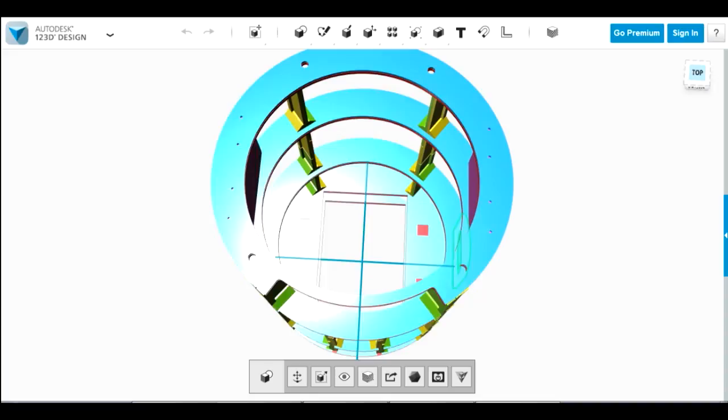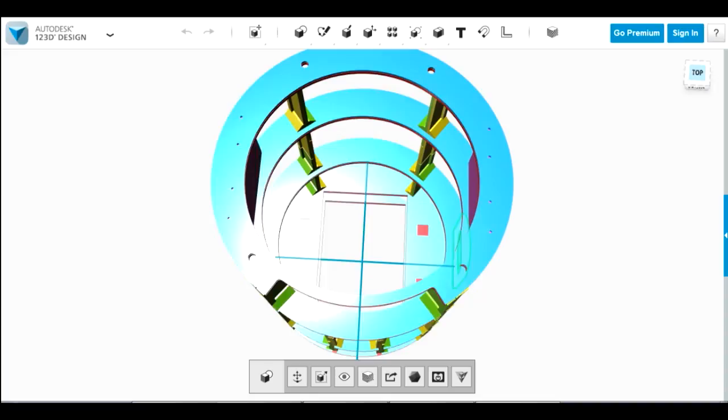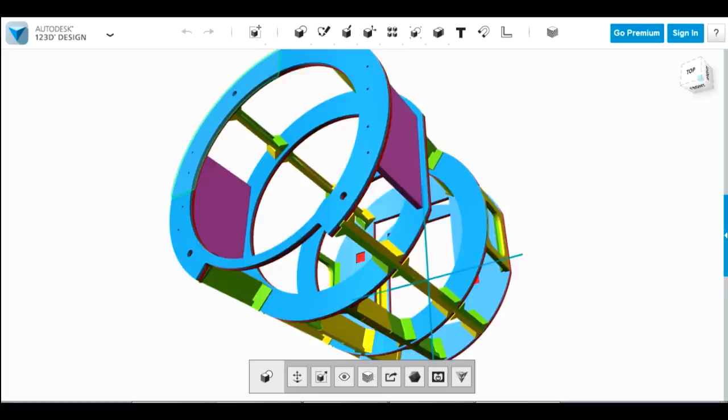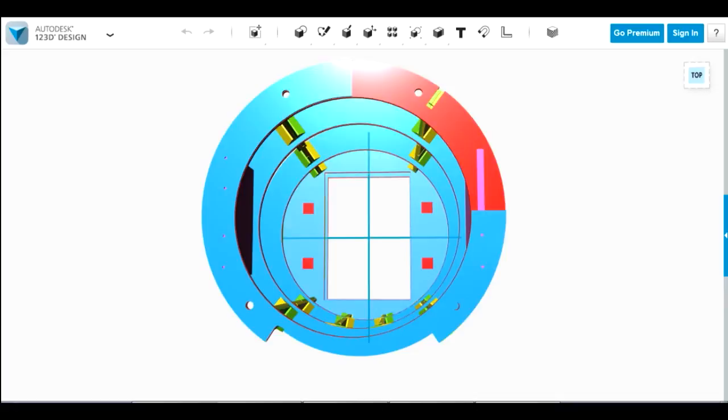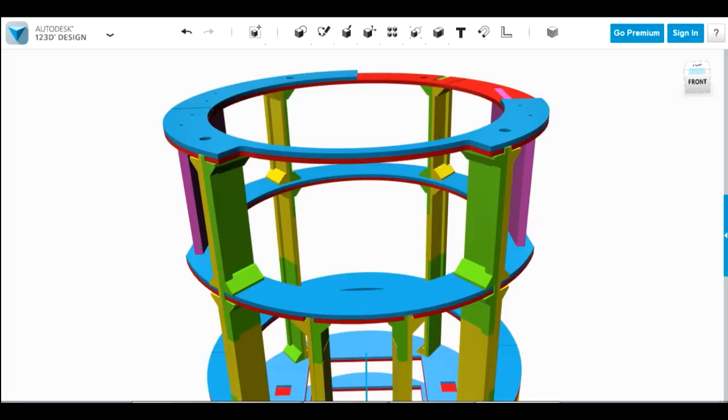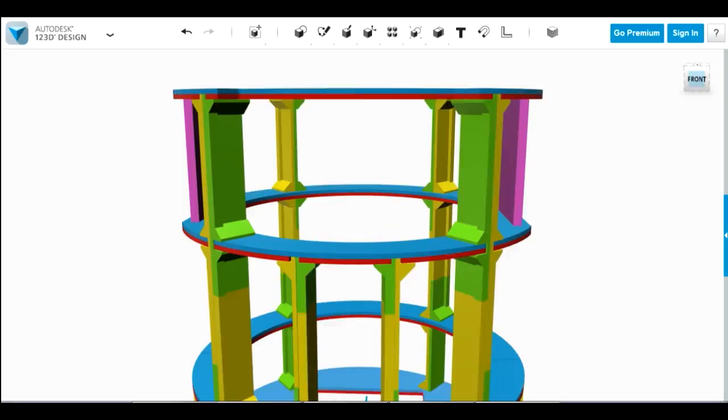This will be printed on my 3D printer, which is a Lulzbot TAZ, and it will just about fit on the printer. The droid is approximately 450mm in diameter, and I've divided it up into quarters which fit on the print bed — about 300 by 300mm. It's in several layers. If I hide this blue layer, underneath is a red layer, and you can see the divide is in a different place to the blue layer. Each layer is made of two pieces stuck back to back, with the seams in each layer in different places to make it nice and strong.